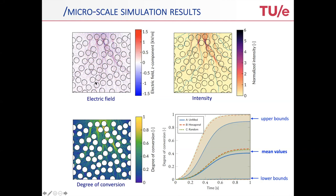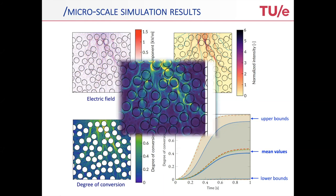If you solve this and look at an aggregate — a piece of the slurry with a certain particle configuration — this is what you get in terms of the electrical field, and the output we distill from it is the intensity. You can see the globalized intensity field here and clearly see how inhomogeneous it actually is. This intensity field is then used to determine the degree of conversion inside the polymer. If you look at the mean values of the degree of conversion, only about 50% of regions are fully cured with the rest not cured at all. This is for the problem of a static laser, whereas in 3D printing we move the laser and integrate the intensity profiles over time, so the curing becomes much better.